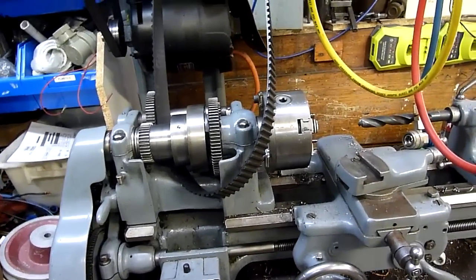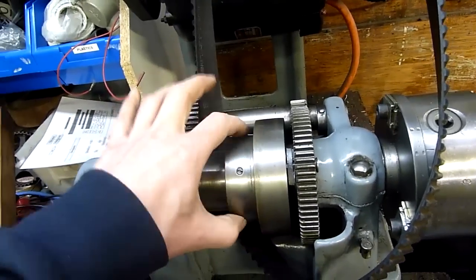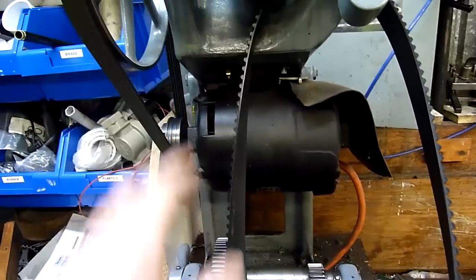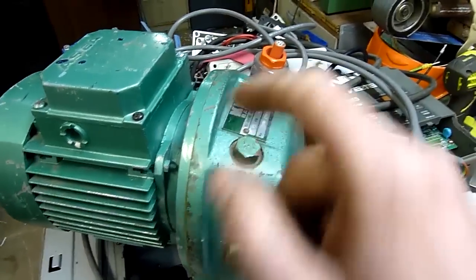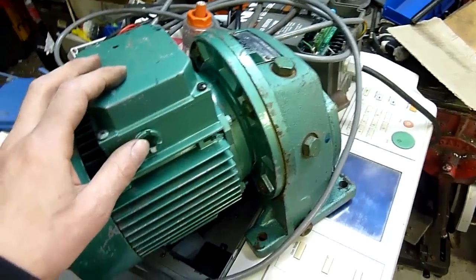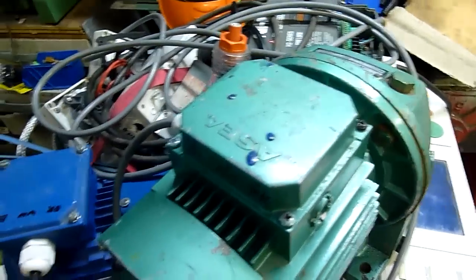G'day folks. I finally decided enough is enough with slipping oily belts on the old lathe. I'm going to non-destructively sheathe this flat belt pulley with a serpentine belt one and replace the entire backstand with a one-to-two or one-to-three reduction box. It reduces 1440 RPM down to 450 at 50 hertz, but I'll be driving it with a VFD. I want a bit of extra overpower on the VFD - I don't want to be running a 0.75 kilowatt motor on a half horsepower VFD because then I'll just keep tripping it out.